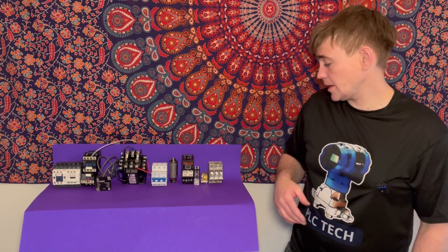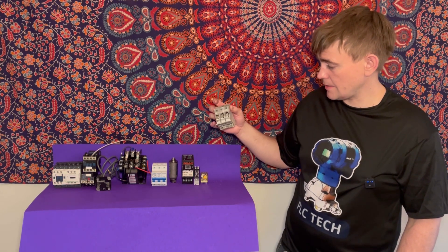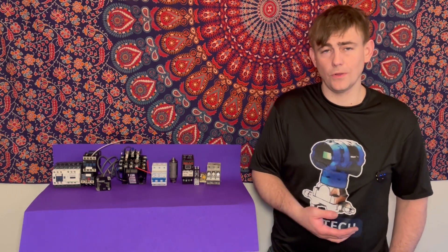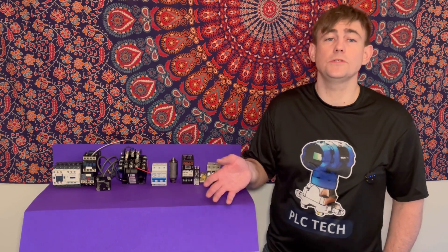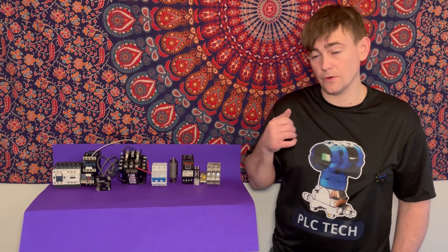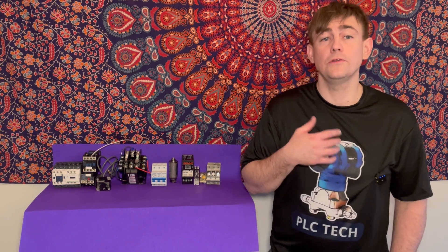After your main circuit breaker, your power is going to run through some fuses. This is a three-phase fuse block, which would be in line for whatever your motor is. The fuses are going to be rated a little bit above whatever your motor's full load amps are. You're also probably going to have some smaller glass tube fuses for other circuits. This is all about protecting the device — when you have a short circuit and sparks are flying, you want the power to turn off to protect people and equipment. Run high current for too long and your wires will melt and things will catch on fire.